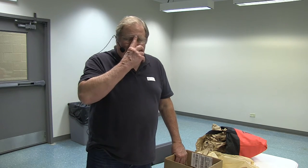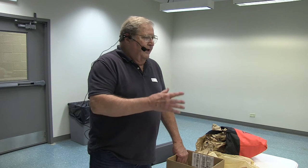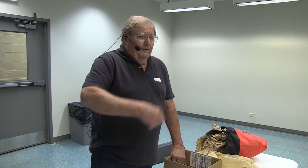But now, is Maloof oil safe? Yes. Is lacquer safe for food? Yes, once all the dryers have evaporated. When that has happened, there's nothing in this stuff that's going to hurt you. It's the dryers that make you sick. I read quite a few articles on that, and I have yet to come across one that says that it's not okay once the dryers have evaporated.